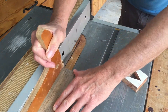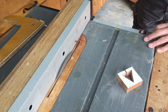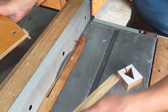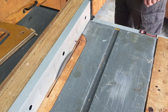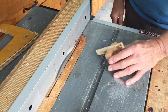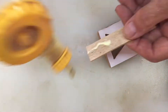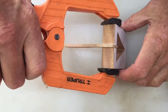I'll use a piece of scrap pine. I'll set my table saw fence to just over 1/8 of an inch, cut a piece and then adjust the fence and cut again and creep up on the final dimension. Once I have the fence of the table saw set, I'll cut the final piece in the hardwood. Then I'll glue it in the slot using regular wood glue, lining it up so that it's flush on the inside of the opening.